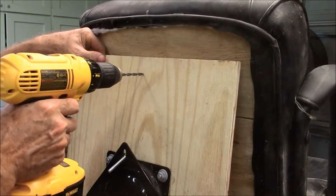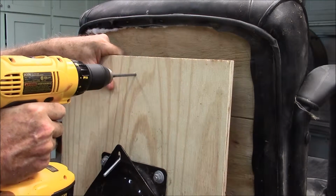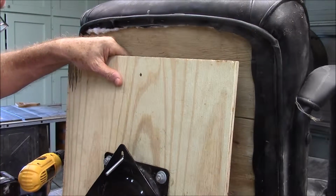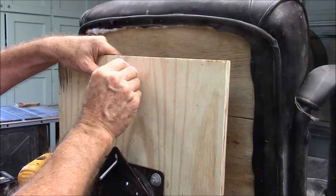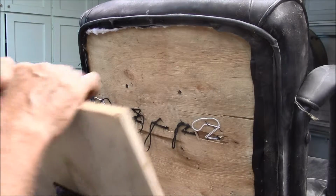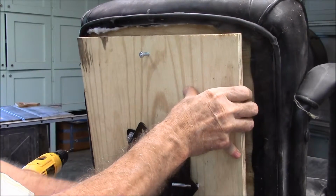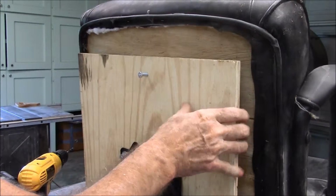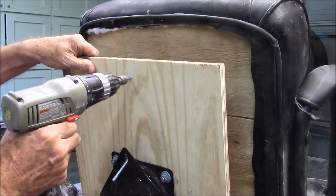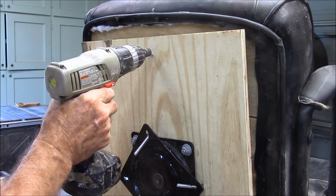I'm going to cinch this thing down with clamps, but for the time being, to get it in position, I'm going to stick it up there with the lag bolts I'll be using. These are only 1/4-inch lag bolts. I think they're 1-inchers. Really don't need anything bigger, since I got 1/2-inch on both sides. Anything bigger wouldn't help me anyway.